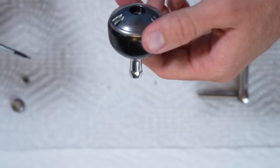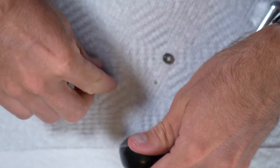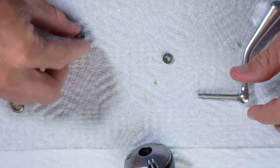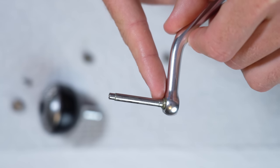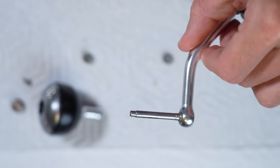There's also another bearing here that's completely fine. Realistically, if I was redesigning this handle, I would use a low-friction bushing here as opposed to the bearing. The bearing gives you that premium spinning feeling, but I don't like that if it's going to be loud after a couple close encounters with salt water. I'd much rather have a slower spin that doesn't become loud after abuse.